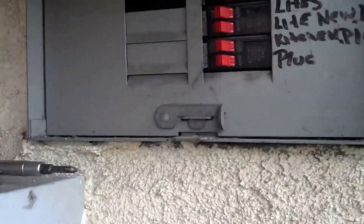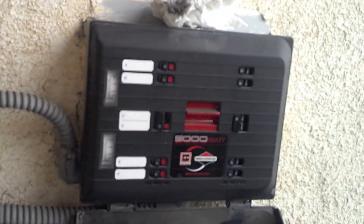Now, if we were to leave these on up here on the main, would we electrocute linemen down the line? Could be — it'll feed back through your main. But if you just click that switch there, the whole house will become energized. So you don't have special outlets or anything? No, it's all of it.